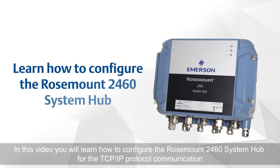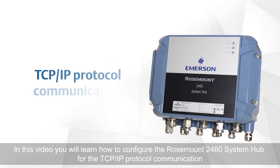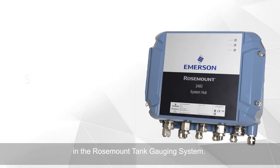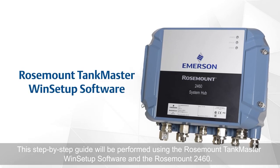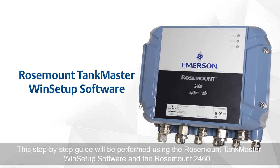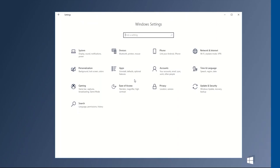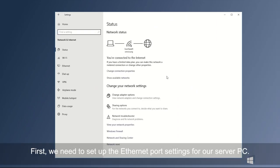In this video, you'll learn how to configure the Rosemount 2460 system hub for the TCP/IP protocol communication in the Rosemount Tank Gauging System. This step-by-step guide will be performed using the Rosemount TankMaster WinSetup software and the Rosemount 2460. Let's get started. First, we need to set up the Ethernet port settings for our server PC.